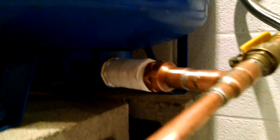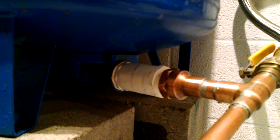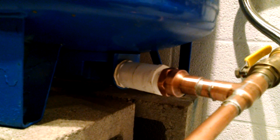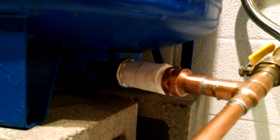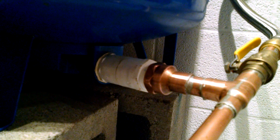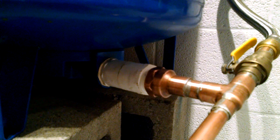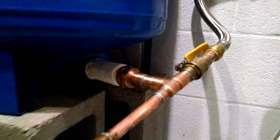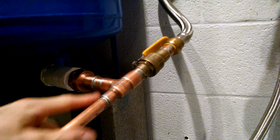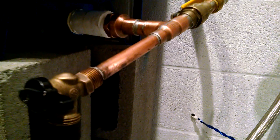This is a Flowtech tank and it has a plastic flange with a female one-inch fitting. I used a couple of one-inch male adapters glued together with a piece of one-inch PVC. I really like to screw plastic into plastic in this case — I wouldn't want to put a stainless steel nipple into that female plastic fitting. I wrapped these with four layers of thick Teflon tape and then painted it with a layer of thread compound. It gives you a perfect seal every time. I then adjusted it after installation to make sure the drain was at the lowest point, using a torch to turn it slightly.